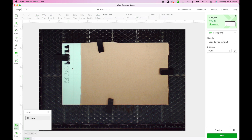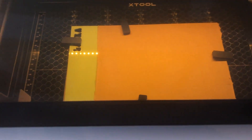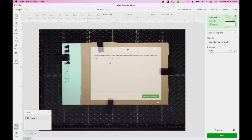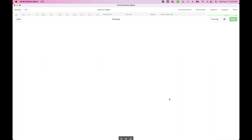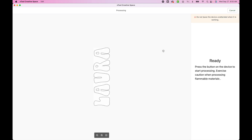I'm going to click weld. Now I'm ready to cut, but the very first step before cutting is always framing. I'll click framing and verify it looks correct on my actual machine. The light is glowing, I push the button, and the framing worked perfectly. I click framing complete, then on the bottom right click start. It previews what it looks like — a perfect time to check if you accidentally left the topper shape on. Everything looks good, so I click start and the laser begins.